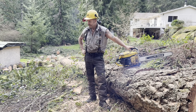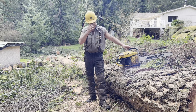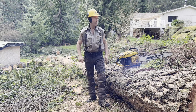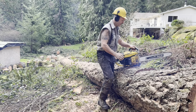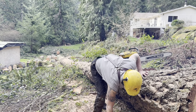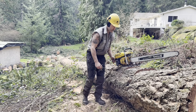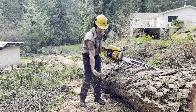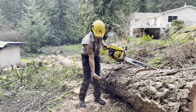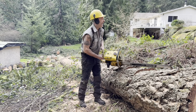So friends, I don't pull these saws out as much as I used to when I was heavy into running the Macs earlier on in the channel. I break them out from time to time, certain saws. This thing's nuts. I'm just going to warm it up. There's a process to these saws. And I found out that the last time I ran it, I think I ran it out of fuel, and it's not getting bar oil. I took it home and the holes were plugged in the bar.